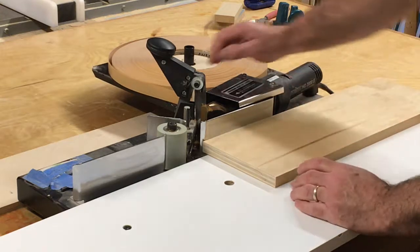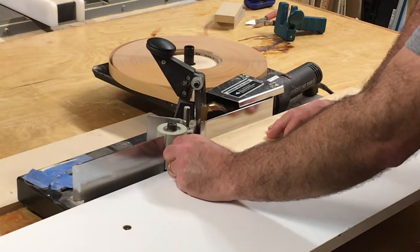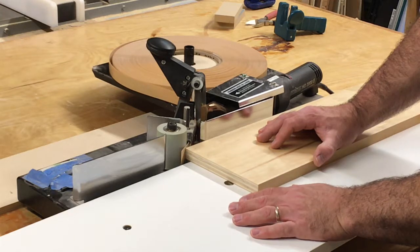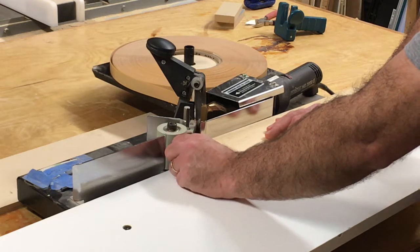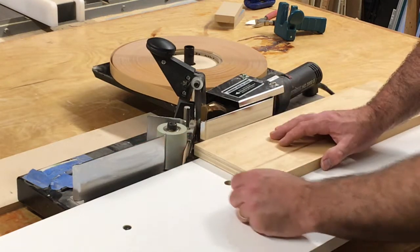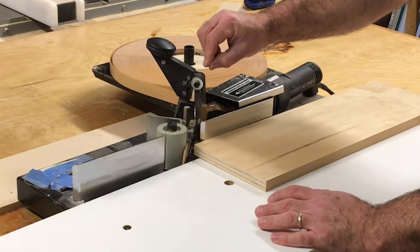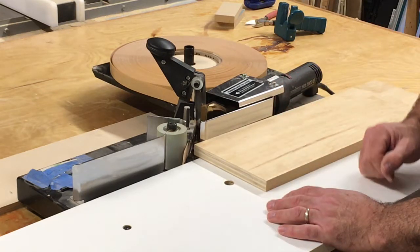When feeding the piece, start in position, turn the machine on, and slowly pull the tape until you see the melted glue, then press your piece into it and feed it through. You have to experiment with the feed rate — with PVC edge banding you can actually start to melt the PVC if you go too slow. With wood banding you can have the heat higher and move a little faster. I have the heat on roughly medium and you just find the sweet spot where the glue is melting but the edge banding is not. At the end, after cutting and finishing the piece, roll the tape back to pull the end away from the heat zone so it doesn't deform and cause trouble on your next pass.